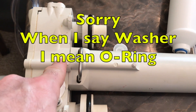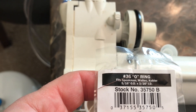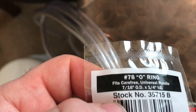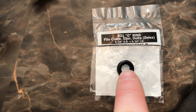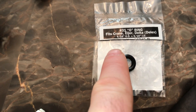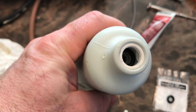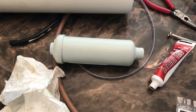The two small little washers on that tab were five-sixteenths outer diameter, three-sixteenths inner diameter. I replaced the gray and red one, which was seven-sixteenths by one-and-a-quarter. I did want to replace the two blue ones, but they were out of the size I needed — I had to buy nine-sixteenths by five-sixteenths, and it was too thick so I can't get the tube through. So I removed that and figured the blue washers are the newest parts there, so I'll hope those two work; otherwise I'll have to go buy two replacements.